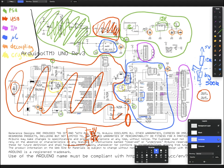So you'll find these in a lot of circuits, and a good value to start off with is usually 10k. If you don't really know what it should be, 10k is usually a pretty good, won't necessarily break much sort of resistor value. But you really should check in your specific circuit what needs to be there.